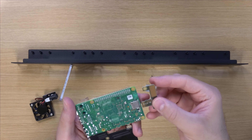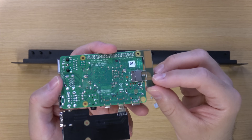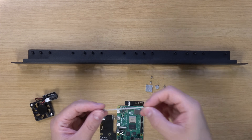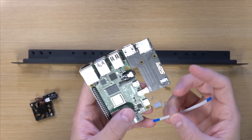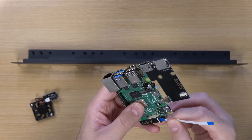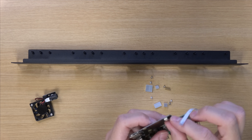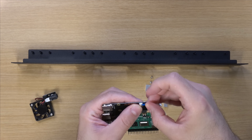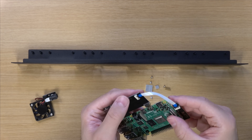For the SD card extender, it's pretty easy - just plug that right in there and make sure the holes are lined up, with everything plugged in nice and snug all the way around. Then we have the ribbon cable. Blue side up, move this flap and gently push this inside, then clamp that down. Make sure this is nice and snug because this is essentially the operating system disk - the SD card is very important.